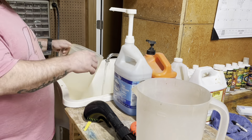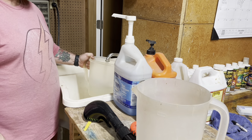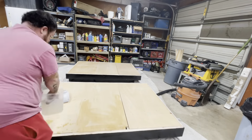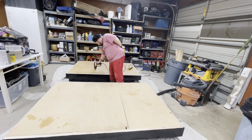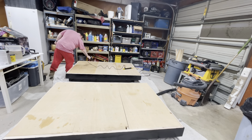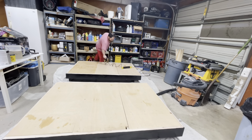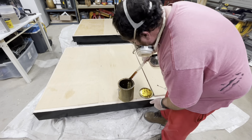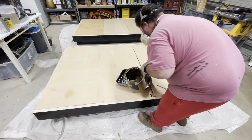After I get it all clean I take the heat gun and go over all the wet spots on the wood. You should really let it set for 24 hours to dry completely before painting anything, but I'm always in a hurry — ain't nobody got time for that. So I pull out my polyurethane. I have a pan just for oil-based stuff and I wipe it out when I'm done. I don't use paint thinner or clean my utensils — the brush and roller get thrown away after the project. Since I put them in the gallon Ziploc bag, I can actually use them for like a week.